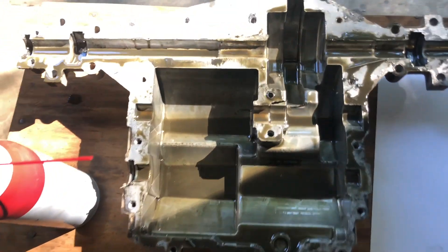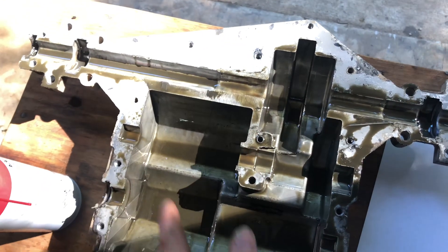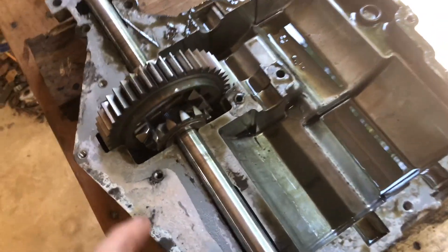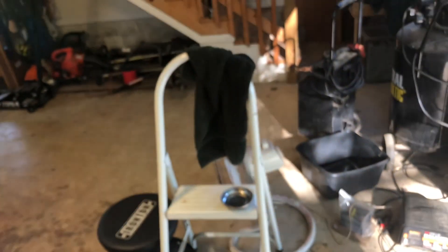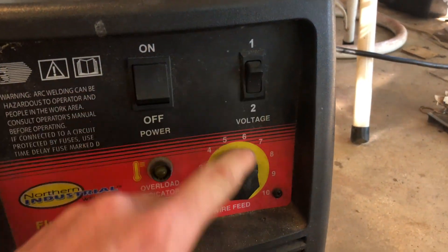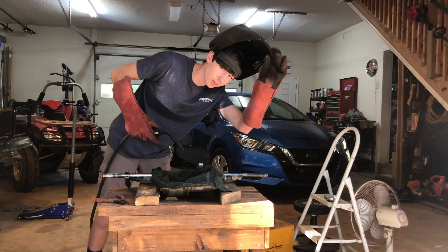I thought about cleaning the inside of the case, and the reason I want this oil in here just a little bit is so if any slag comes out it'll be a little bit easier to clean up. I got the shafts and bevel gear and everything back in there. I'm going to position it the way I want, cover it up with that towel, and tack it in place. Let's get our settings dialed in - hopefully I will not screw this up.